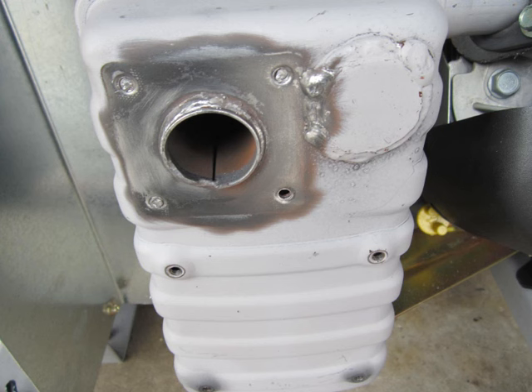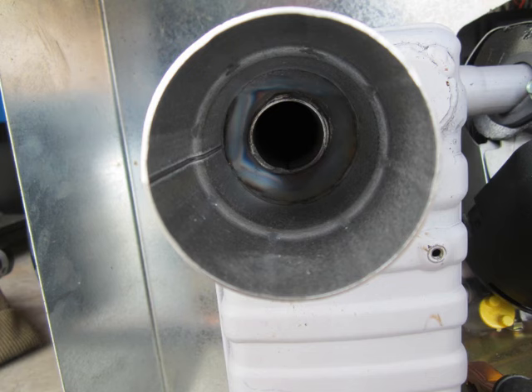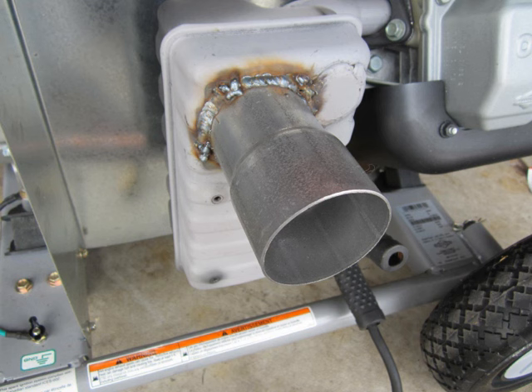This is an important step in order to get a decent weld. The small end of the adapter was sized to surround the GEN-SET muffler outlet hole, while remaining small enough to not extend over the edge of the muffler or collide with the weldment next to the spark arrester. The large end of the adapter needed to match the flex pipes, which in turn needed to match the fitting on the car muffler, all of which are 2.5 inches. Note that the flex pipes are 2.5 inch inner diameter, while the solid fittings are 2.5 inch outer diameter. Next, I held the small end of the adapter up against the GEN-SET muffler and centered it with the hole. I used my welder to tack the adapter in place with three spot welds around the perimeter where the adapter met the muffler, then placed a weld bead in between the tack spot welds, sealing the adapter to the GEN-SET muffler.